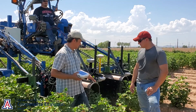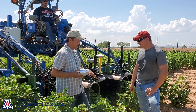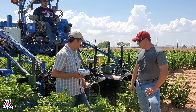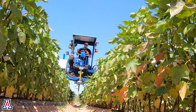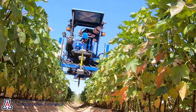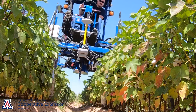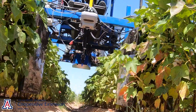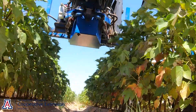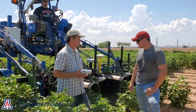In this case for cotton, we're after spraying the herbicide on those weeds that are between the plant rows. In this configuration, at this height, and with all the geometry taken into account, we are basically scanning 85% of the area, and therefore we can spray that area — 50% will be the seed plant.